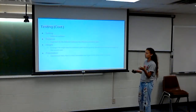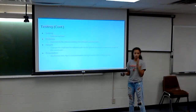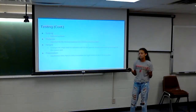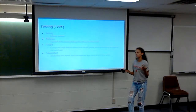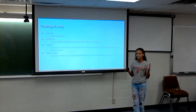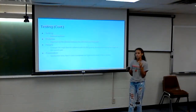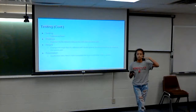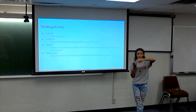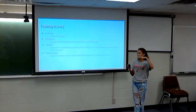What we wanted to do with this setup was take it outside and test it on different surfaces to see how those surfaces affected the signal we were receiving. That's important because it shows how those surfaces, and changes in height and distance, affect the destructive interference. When you change the height and distance of the setup, that changes the angle the reflected path hits the ground, which in turn changes the time delay of how fast the reflected path arrives and interferes with your direct path. We tested at four different heights on different settings.